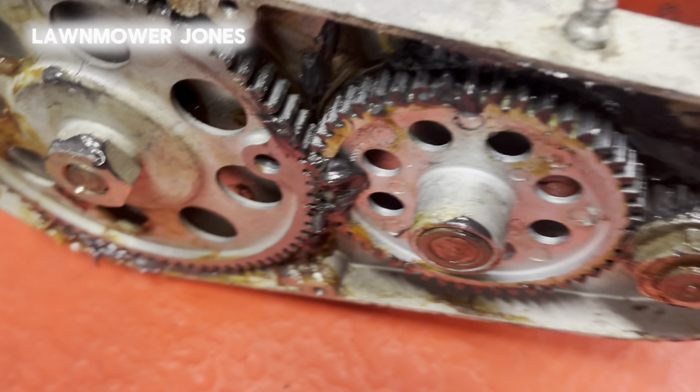The other important adjustment is your on-cut — the adjusters on either side. As it wears a little bit and you find the cylinder's not touching at all, just back the little lock nut off either side and tighten the adjuster down — just a whisker, that's all you need. Once you've achieved it evenly both sides, ideally it should cut paper all the way along. If it hasn't been sharpened or back-lapped, it should be folding paper and touching the bottom blade, but you must be able to turn it. That's the adjustment.